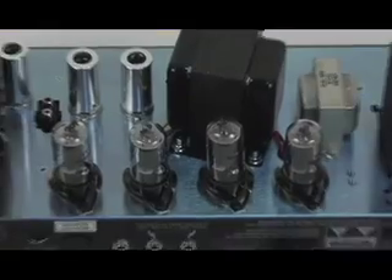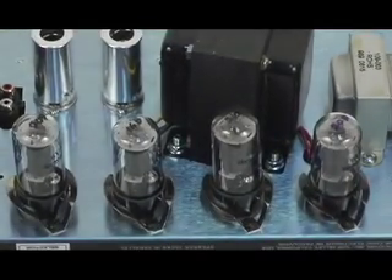I've taken this opportunity with the release of the 6V6 GT from Electro-Harmonix, which is a rugged 6V6 — sounds amazing, has really super tone — and it is really a rival to the EL84s. Using a quartet of them, we're able to get a reliable 35 watts. 35 watts is actually an optimum amount of power for a Class A power amp for most live situations.